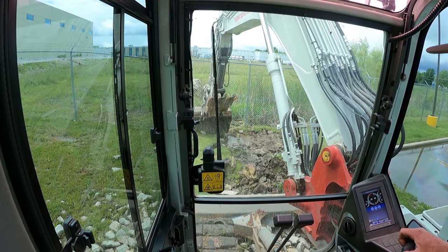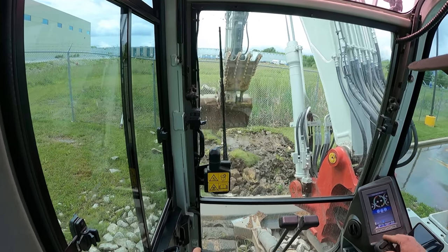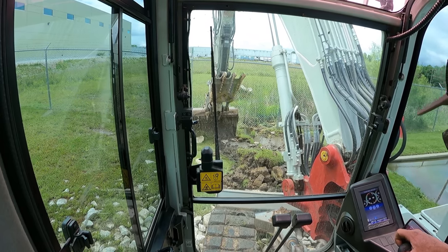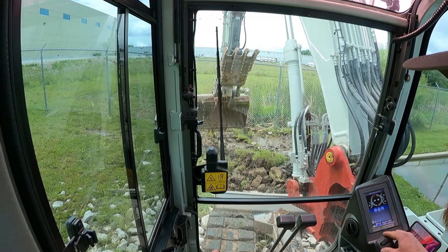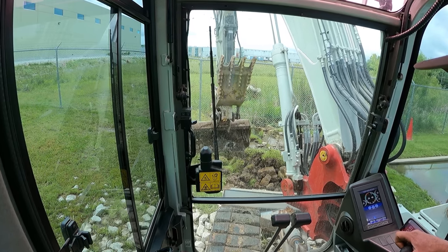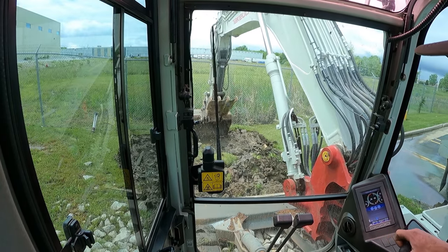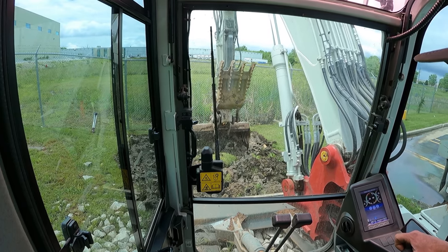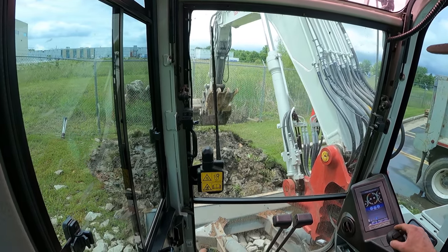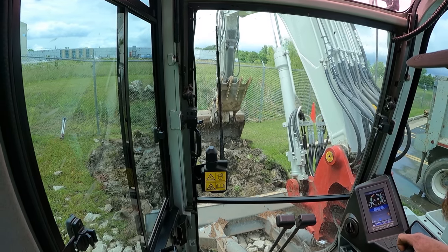And I think, I don't know, I could be wrong, I think it was built a little high originally. So now I'm having to dig out all the riprap and sediment and junk, haul it off, and then we'll put fabric down and line it with new riprap. Problem is, to dig it down where it needs to be, the water is going to run back in from the pond.